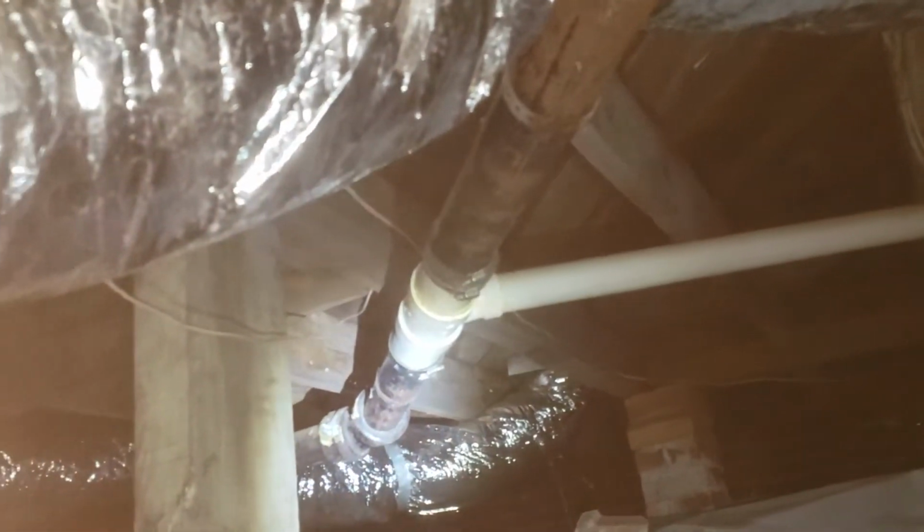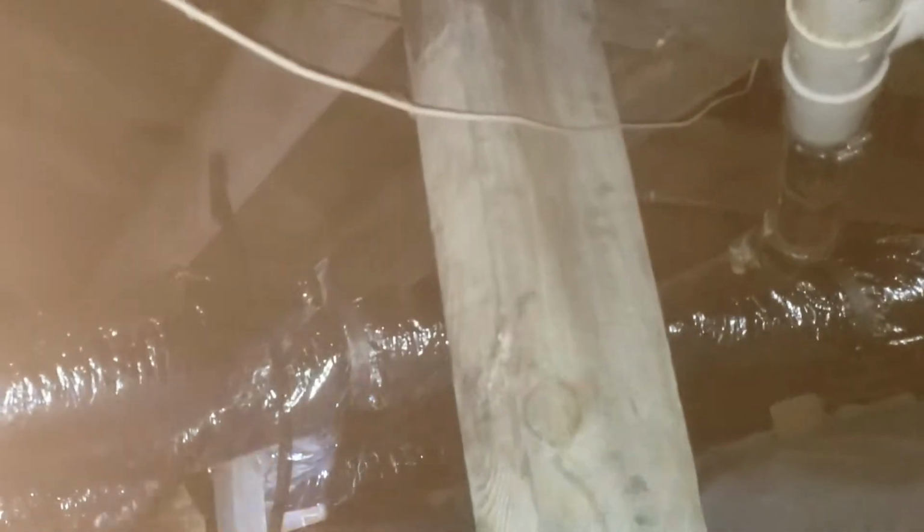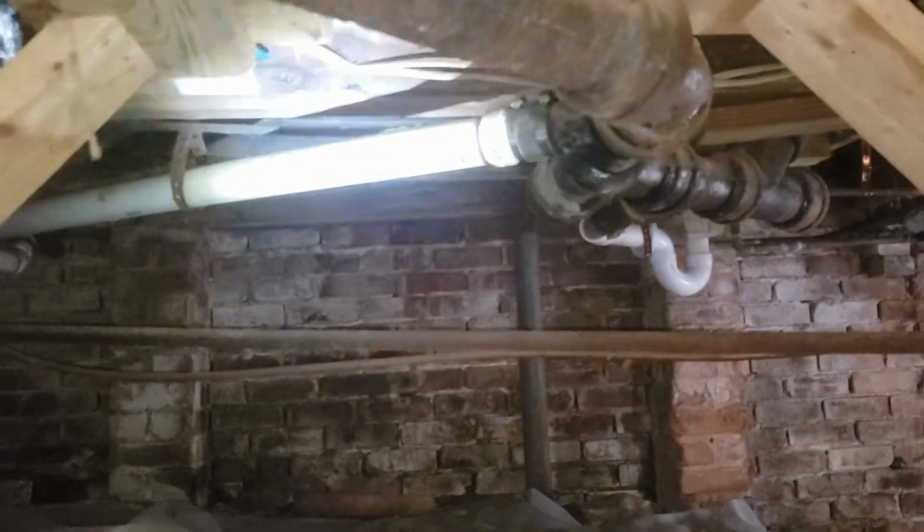Okay. But the air pipe in the wall wouldn't have to be replaced, right? No, we're not going to worry about the vent. Okay. Vents, all vents do is handle air. So then we got, I'm going to say 25 to 30 feet of 3-inch. And then a tie-in for a wash machine there. And 3 fixtures over here.